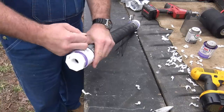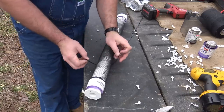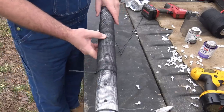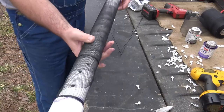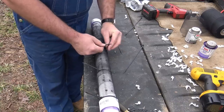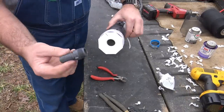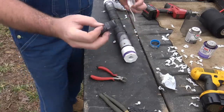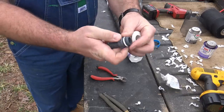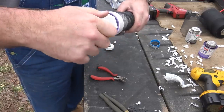Now I'll show you how we hold this in place. Zip tie it on one end and move on down the line. The filter material is temporary, the zip ties are temporary, but this whole apparatus is a permanent structure we'll continue to use on the farm. We'll put about five zip ties across here. Here's what goes in the end of the filter — a three-quarter inch pipe thread to three-quarter inch poly. I'm going to put a little Teflon tape on here even though it's a low-pressure system, because I don't want to suck any air in.